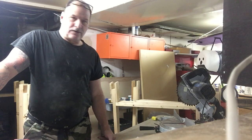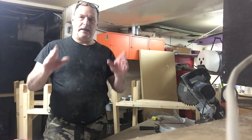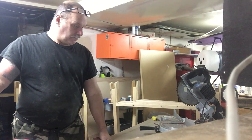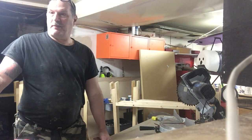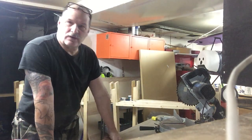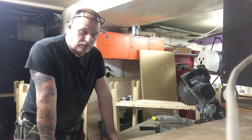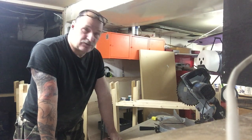Now, another thing I was looking at: these sheets are butted together, and it has a piece of wood over the seam that goes on the inside. I don't really like that idea. It's okay. I mean, it works. People have done it. People are doing it. But I also have seen people scarf joint the edges and use epoxy with a micro filler of some kind and clamp them together and make a long sheet. And pick up that whole section of sheeting and throw it on the side of the hull, and screw it in place.